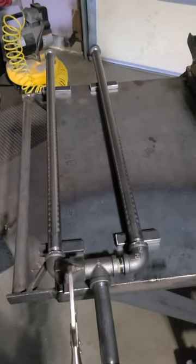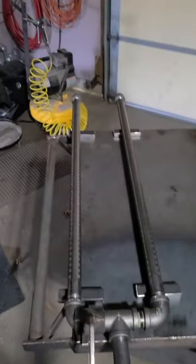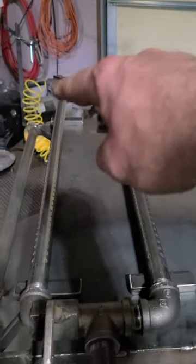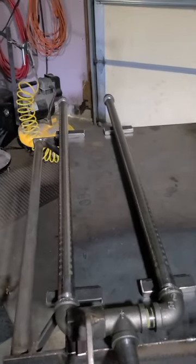It's a yellow putty rated for gas and said it can go up to 500 degrees. If it ends up cooking, it cooks — oh well. I'm going to let the thing burn pretty hot one day before throwing it in. Still got to throw on some rods here and here, going up about two inches, and then a piece of angle that goes down the top of each one, which will be a heat shield, a drip shield.